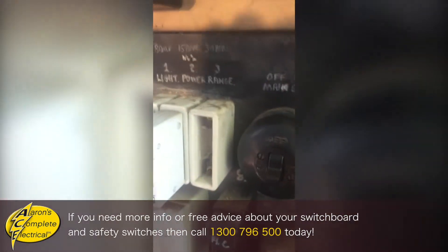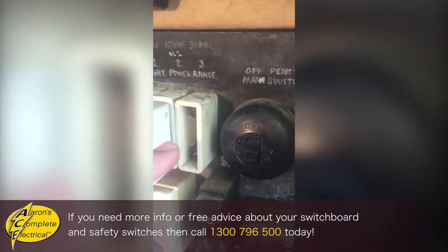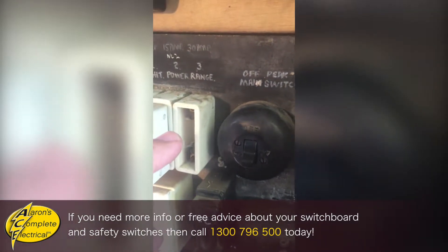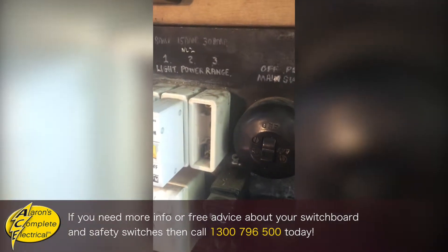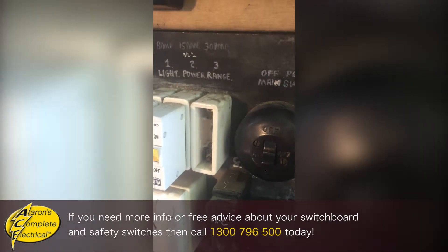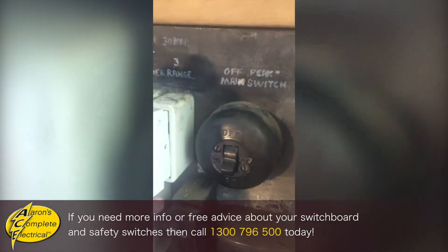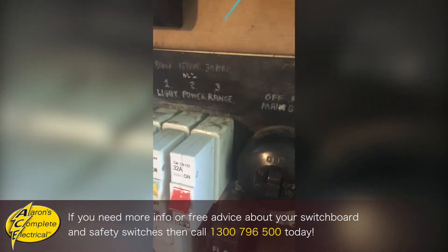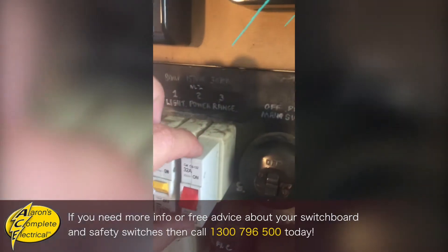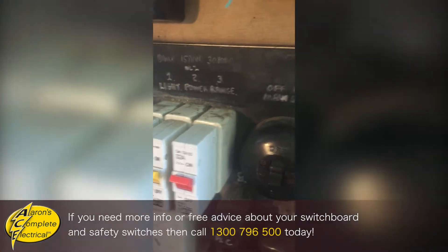The plug-in circuit breaker is exactly like it says — that's where the old fuse used to go. Just be careful, don't stick your fingers in there because those terminals are live, which is another reason why these ceramic fuses are really no good. They're just such an obsolete technology. People would have changed them over to these plug-in breakers because they were blowing fuses too often. That's a close-up of your plug-in circuit breaker.